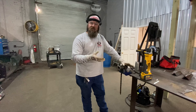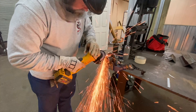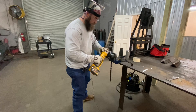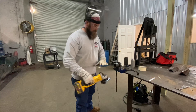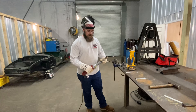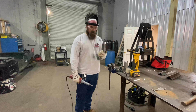Now I'm going to show you some of the common mistakes we see — what gives people a lot of problems when they're first starting out. A lot of times people come in and they dig the grinder in. It's all about positioning — a lot of times they want to get right in front of it and grind like this. You want to keep the grinder following the contour of the pipe so you can see what you're doing. Going forward and backwards, making one pass at a time, you can visually see how much metal you're taking off. As for cleaning, you want to clean the inside and just on the outside — you don't have to go back a quarter inch for it to be a good weld.